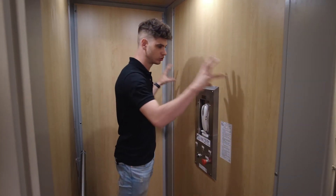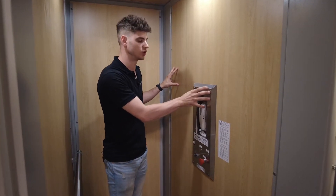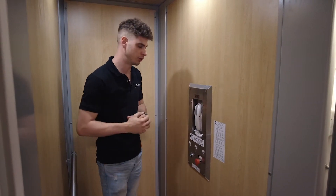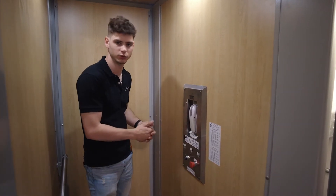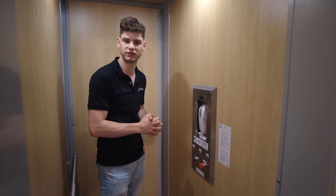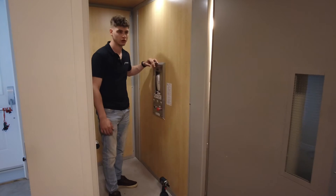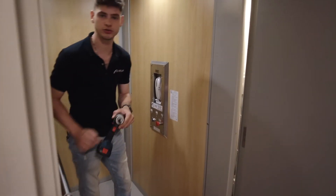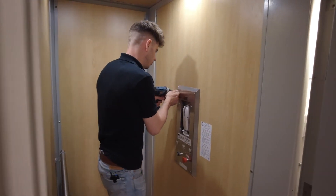This is our control wall — the wall with the COP, the control operational panel — which is always the one with the rails behind it. I'm going to go through the process of removing this wall to look at what's behind it, including our speed governor. Our first step is to remove the COP, which is done entirely with a Phillips head screwdriver — four bolts at each corner.